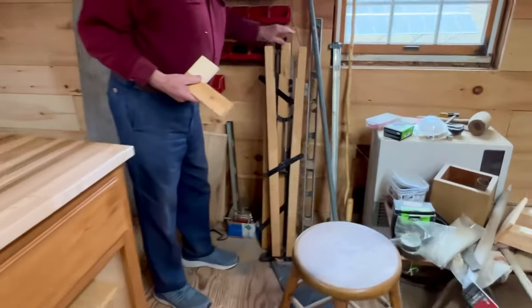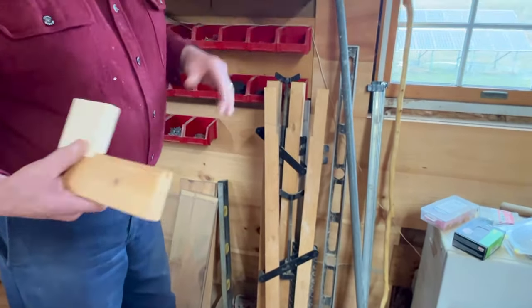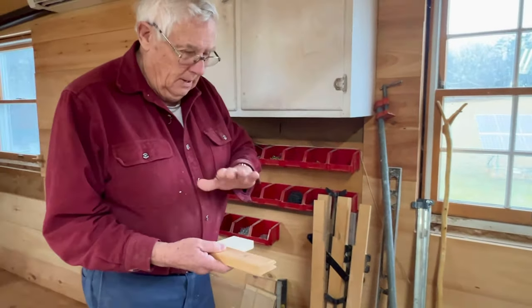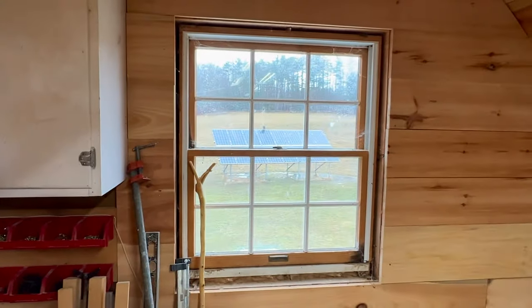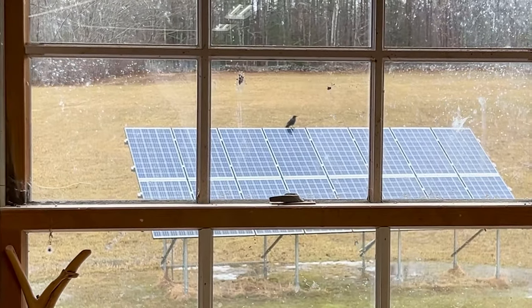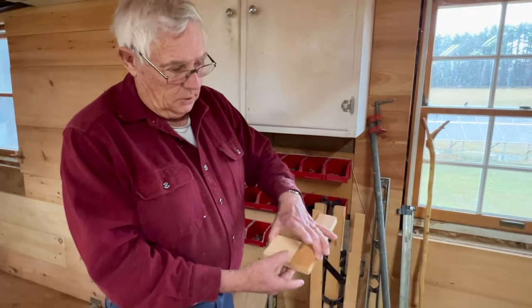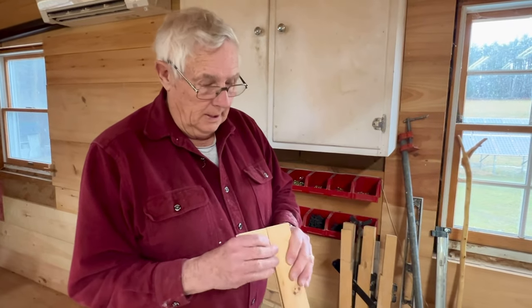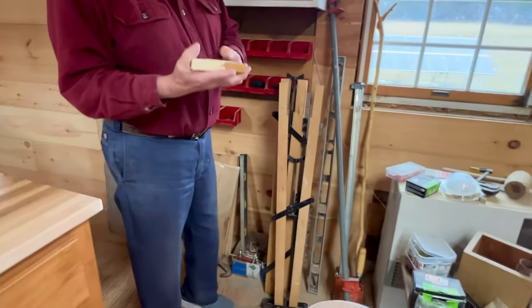I use these 2 clamps, and I'll show you more once I do the assembly. These clamp it not only flat, but they keep everything flat and they force it together. You know, they clamp this way and they clamp this way at the same time. Gotcha. So it keeps the door flat as you're assembling it. It won't buckle or warp or anything. Right. Those are cool clamps.